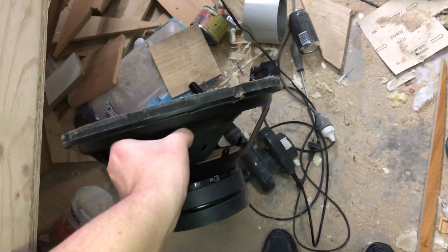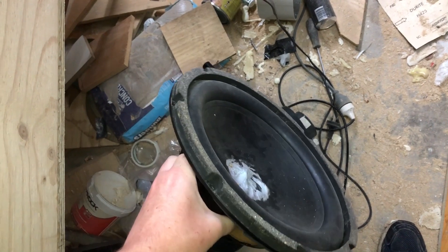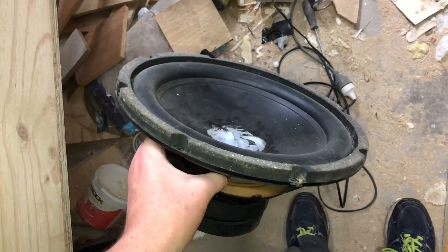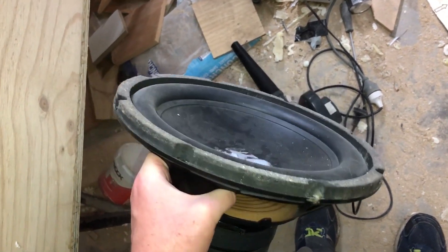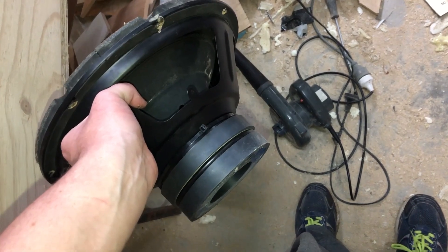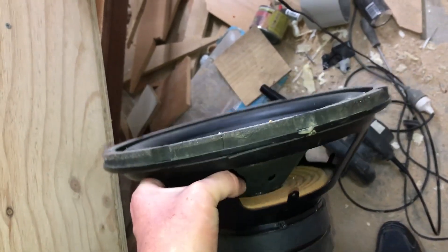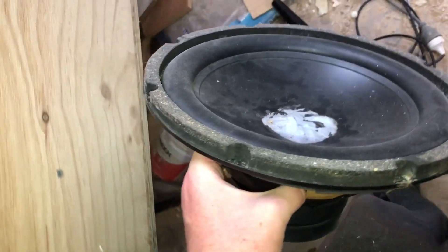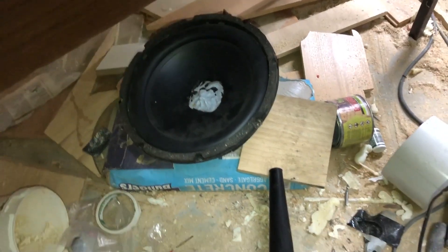I will take this time to introduce you to the temporary test driver. This is a J-Car sub. J-Car's like Radio Shack, I think. It's just their home brand response home subwoofer. Although it's got a really low Q. And it's got a single magnet with one of those kind of reflector magnets on it. So not mega excursion even though the surround's pretty chunky on it. And it's an 8 ohm, 225 watts. I've got a car amp which will do 200 watts into 8 ohm which I'll pair up with that temporarily for testing.